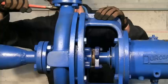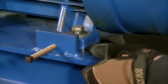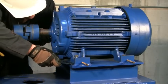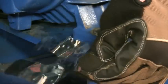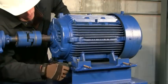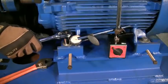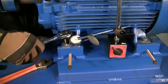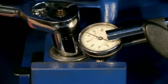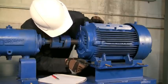The API 686 spec recommends the pipes be disconnected from the pump before a softfoot check. Now that the area has been prepped with the bolts still loose, fill in any obvious gaps that exist between the feet and the base. When going around to each foot, remove and inspect the existing shims — if you see any shims that are bent or crinkled, replace them. Consolidate shims and make sure you have no more than three or four shims under each foot. All shims should be snug under each foot when the hold down bolts are loose. We recommend using feeler gauges to measure the gap under the corners of each foot to make sure the angle is captured.